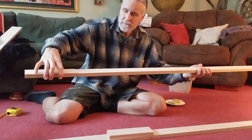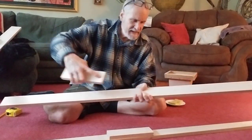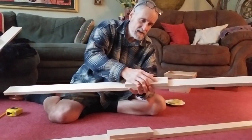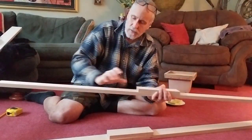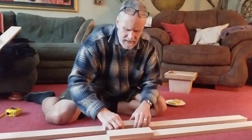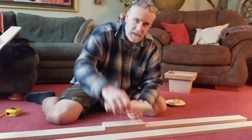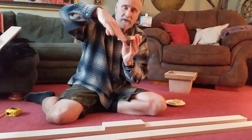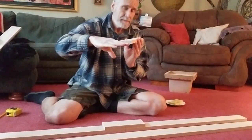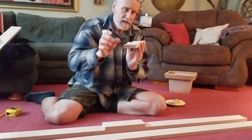This riser came from this end — I mark it. There's a B here and a B here with arrows. The grain pattern is matched, no runoff. They are a little steep. I'm going to use this here. Too steep for some applications, but beautiful for a rawhide-backed bow, or for a parallel-limbed bow.